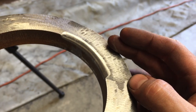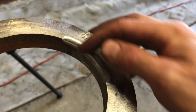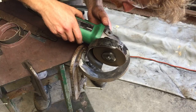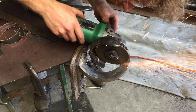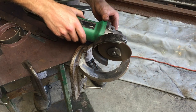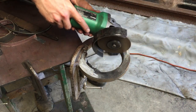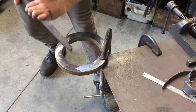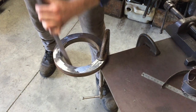This is one of the water end cylinder flanges, and I've shaped this radius on one section, and this lines up with the port in the valve chamber, and the radius provides a smooth transition for the water as it enters and exits the cylinder. That reduces the resistance to flow, and by smoothing that passage of the water into the cylinder, the power required to pump a certain quantity of water is reduced. These small details all add up to a significant saving of steam.